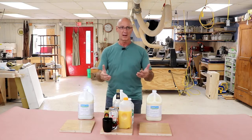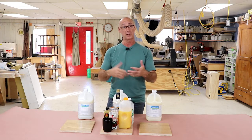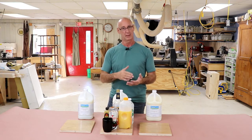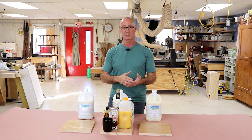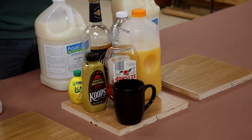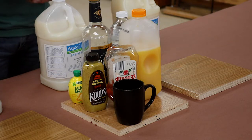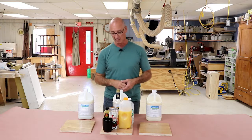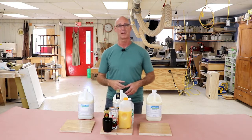What do these all have in common? They're all liquids, and a lot of finishes just don't hold up to liquids in general. Two, this is all really highly acidic stuff. The way this test works is that these items go onto the boards and sit for 24 hours. Mustard sits for only one hour. Then when they come off, we have a look at the results. Next step is to put the stuff on.